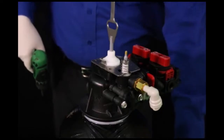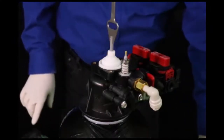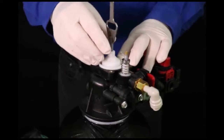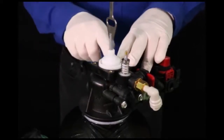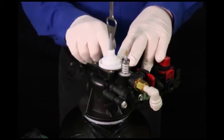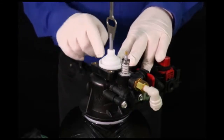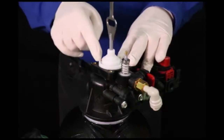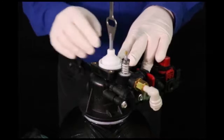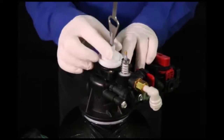Set those aside so we don't lose them. This plate lifts off. Next thing you do is remove the piston. You want to make sure that the seals and spacers inside this body stay in place after you pull this off, because if you're doing diagnostics, you want to see if there's debris in there, any plugging, any ripped seals, anything mechanically going on inside this control valve. We're doing a troubleshoot, a diagnostics, to see what's going on — we need to see how everything lays inside the system.